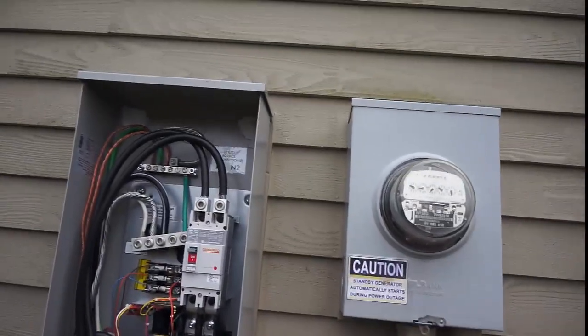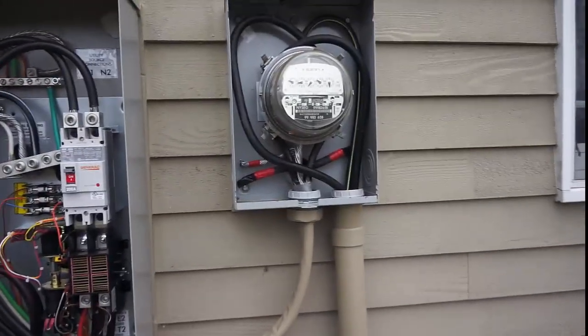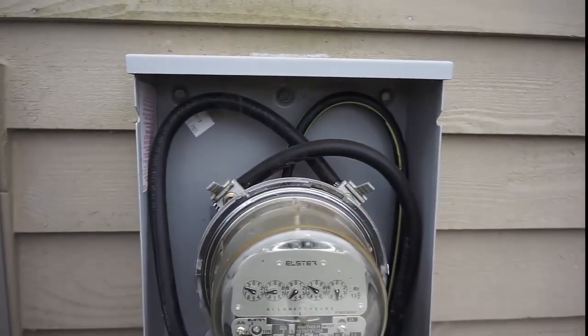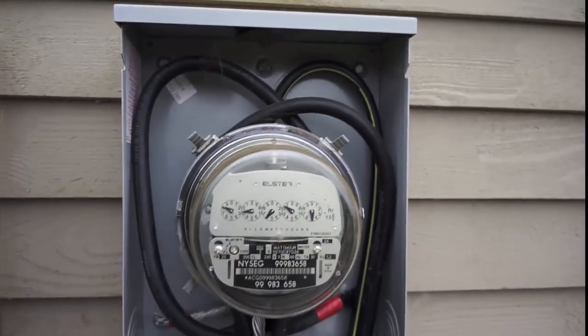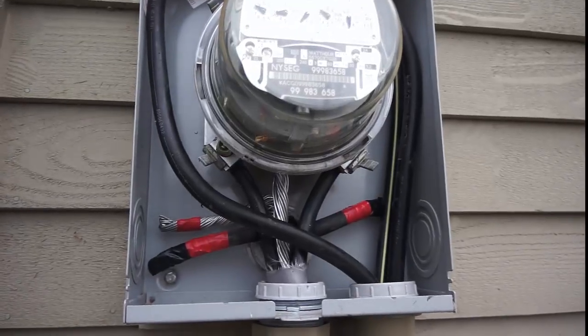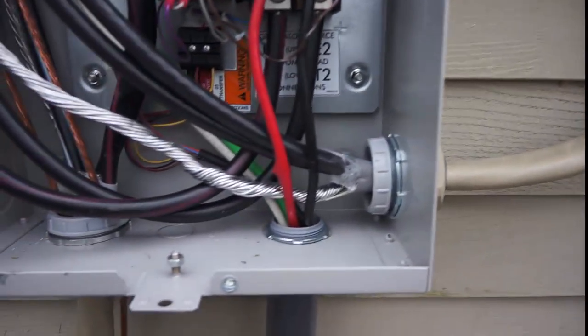A few things about the connections. Inside the meter — I suppose I could pop this thing off and show you what I have done. I terminated the cables that used to go into the house and I put red tape on those. The main utility power, which comes from my transformer, comes up to the top of the meter. To do the connections, I pulled the meter off. This was still hot on the top — I just stuffed a piece of cardboard in there temporarily to keep my tools away from that. I did my connections with SEU cable: 4-AWG, 4-AWG, 2-AWG, coming out of the bottom and into the transfer switch. It comes into the transfer switch up at the top, and this is my utility power.